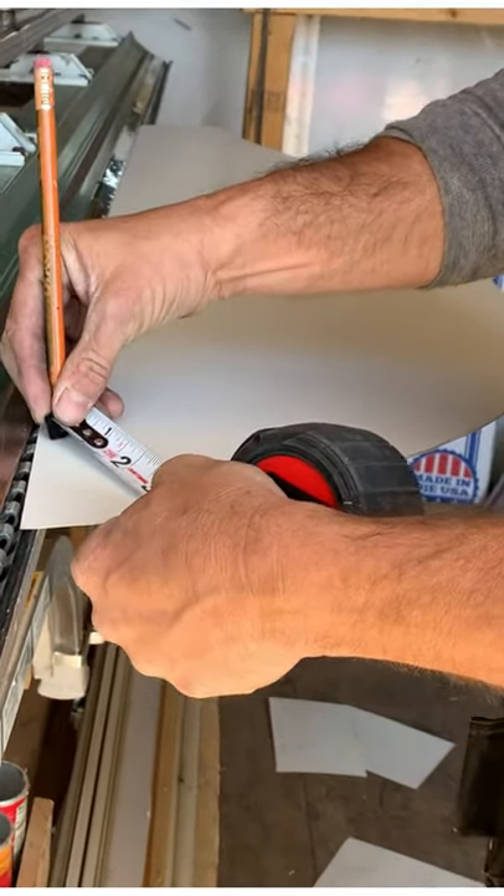Just enough to get this line at 3-5/8. This is making a keystone. Since I'm 3-1/2 inches, I'm going to go about 4-1/2 or so. I generally go about an inch longer and an inch wider than the face of whatever keystone I'm putting on. If it's a 6-inch header, then I'm doing a 7-inch by 7-inch square.